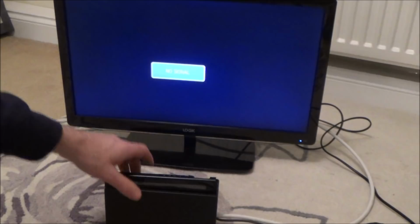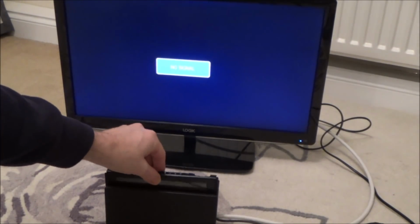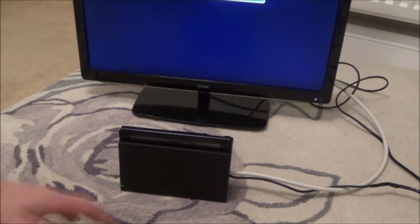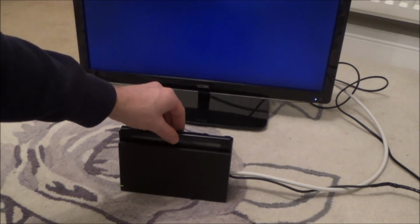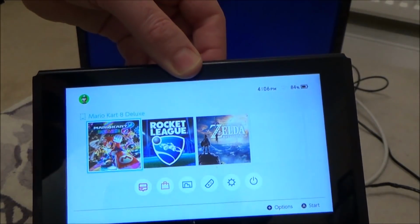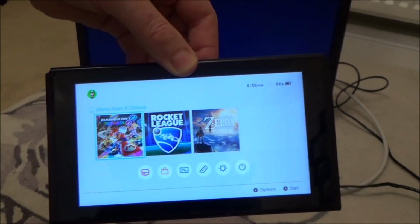A viewer mentioned that by the video chip, there's these little filters, and sometimes they can blow, which can cause the non-docking. So I might as well check them out. It means popping the board out one more time, but I might as well have a quick look at that, just in case. And then if that's not it, then I will definitely call it a day on this switch. I don't think this switch will be taken apart again, because every time I take it apart, the more chance I've got of, for example, ruining that ribbon cable connector that feeds the screen. And this is a working switch, so I was a bit disappointed there when that USB port wasn't working, and now the fact that it's charging again, I don't really want to push my luck with it. So let's take it apart for one last time.